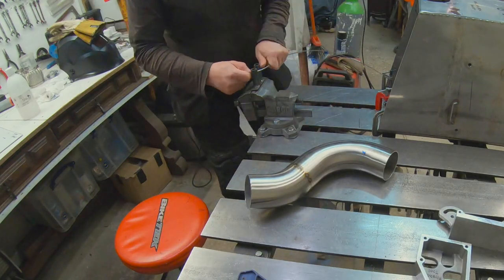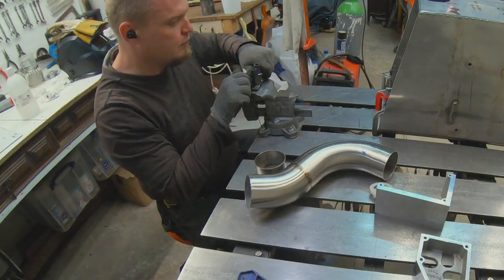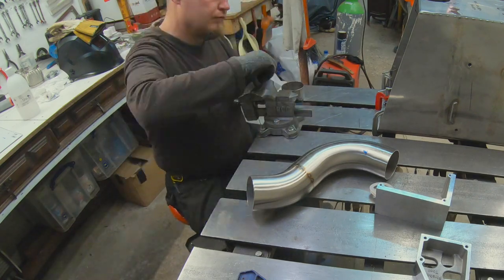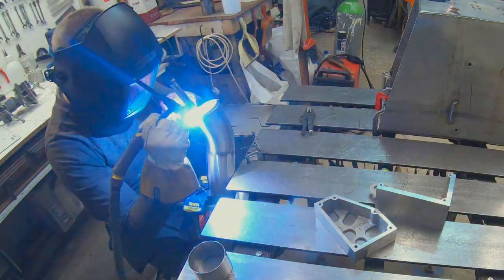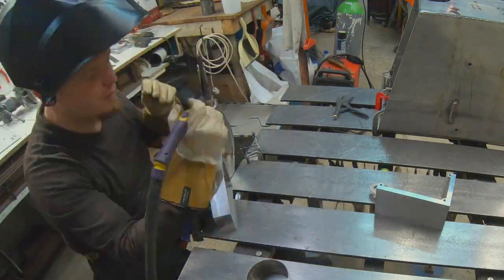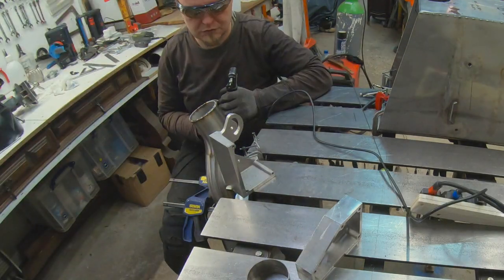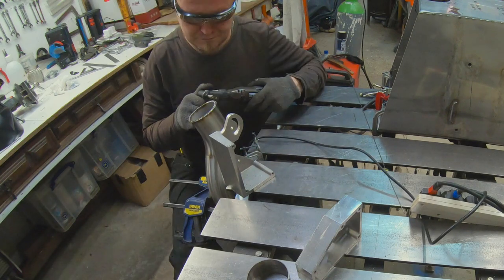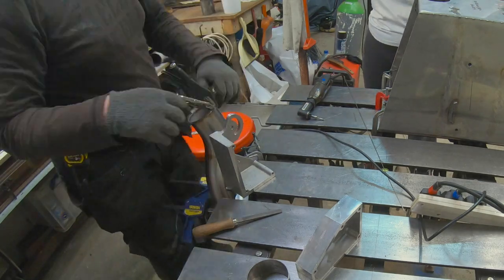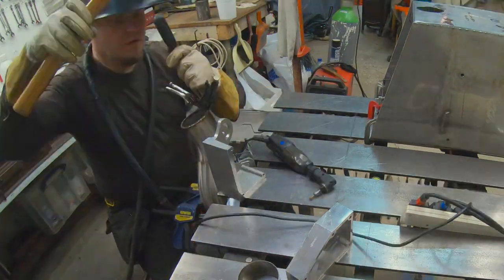The steel rod bending contraption is nothing more than a piece of angle iron with two parallel tubes welded to it. By putting the steel rod in between, I can put a slight bend on it. Repeating this gives me a roundish shape, which is good enough to clamp onto the end of the tube. I use the Dinky Derricks to hold the thin rod in place and put a tack on. I move the Dinky Derricks around and keep tacking till I've got the tacks all around the tube. When I'm close to closing the circle, I use the Dremel with a cutoff disc to get the ends to meet, and also a bit of hand filing so that I can sell the exhaust on Etsy as handcrafted should I want to. Then back to the Dinky Derricks and the final tacks.